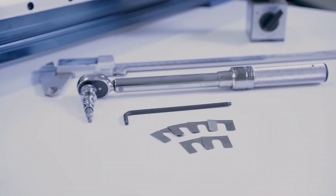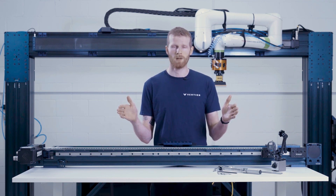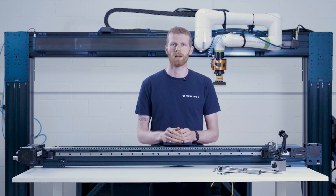For the second half of the video we're going to be covering shimming. You might need to shim because your guide rail is traversing multiple extrusions. These extrusions have some variation in manufacturing, and when going from one to the other you may have a slight change in width — this would be a situation where you would need to use shims to offset that change. Another situation where you might need to use shims is if you have a very large assembly and need to get your final alignment into place instead of moving around large pieces of the frame to achieve your alignment.